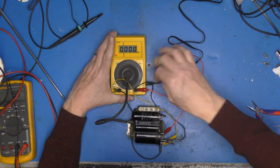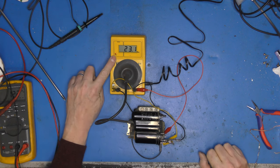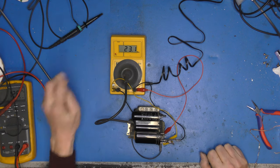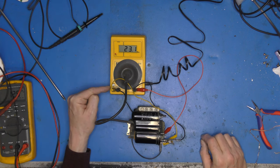And if I plug it in, it thinks about it for a while. The red light goes out. That's the important bit. And we have 23.1 kilovolts. It's not really kilovolts. It's quite a low voltage, actually. And on this pin here that you can just see on there, if I scope, I get lots of lovely pulses, which I should be. So I think our transformer's good.